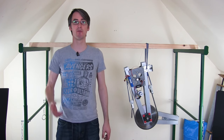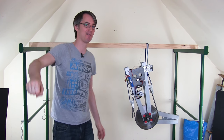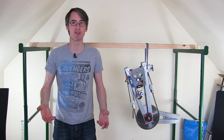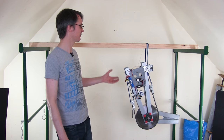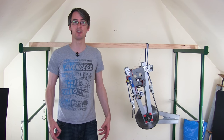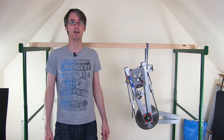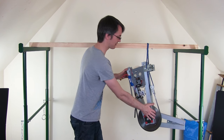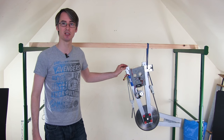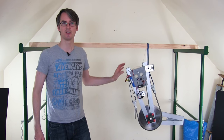Remember there are four axes — three at the shoulder and one at the elbow — so I still need to replicate this four more times and build that into something I can carry around to make my arms stronger. Of course the obvious thing is I won't actually be able to lift the weight with my back and legs, so if that works well the plan is to build the legs as well. There are a few things to tune and tweak — mainly some work on the gearbox development. This one works fine with 3D printed plastic gears spreading the load over those blocks and tackles, but I could do with something more compact, perhaps a planetary gearbox built to a higher tolerance. Also this is actually quite heavy — the steel bearing blocks and sprocket weigh quite a bit, so I probably need to rethink that and see if there are some lighter materials I can use.